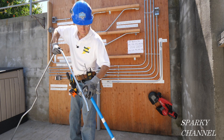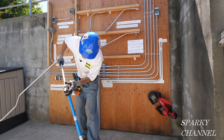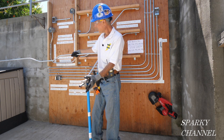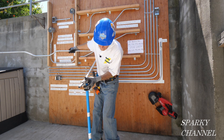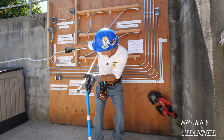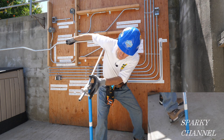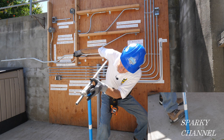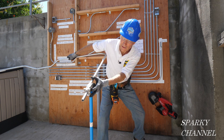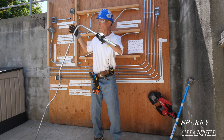It's a little harder to do with a long piece of conduit, but put the arrow right on the mark. This goes to zero degrees — put your armpit on it, keep that at zero degrees, handle at 90 degrees — and go to 10 degrees again. Check it out, looks good. There's your box offset.